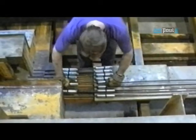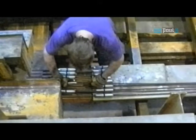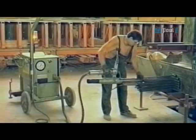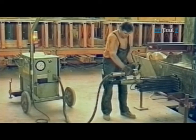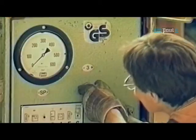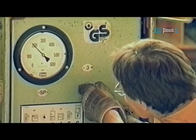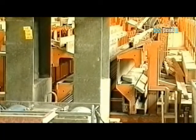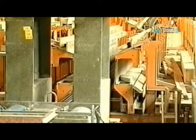Pre-stressing steel couplers economize on pre-stressing steel if the casting bed is longer than the concrete element produced. Before the actual pre-stressing, all the strands are tightened. The oil pressure required for this is set on the pump unit. As soon as all the strands are drawn in and tightened, the mould can be closed.